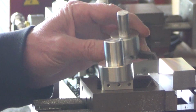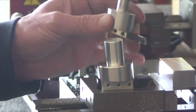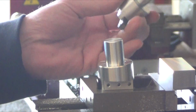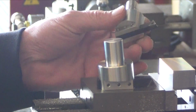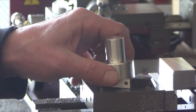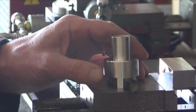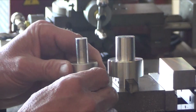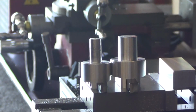This is the original one. And I had to make it that small because in the beginning the only thing I had was a chuck. And the chuck could only go up to a half inch. And there's the quarter-inch Harbor Freight insert, or cutter, whatever. So that finish is nice. Somehow this is doing a lot nicer job. I don't know whether it's because there's less flex in here. As you can see, there's a serious difference in them. It's quieter. I don't feel as much vibration. Well, neither of them gave me much vibration in the head. But it's just nicer, it's different, and the finish is just gorgeous.